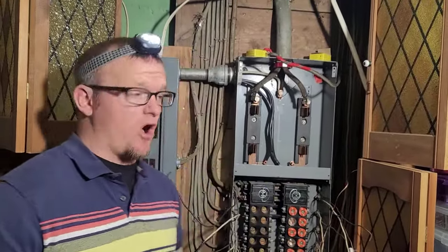I finally got my branch circuits worked in and terminated my mains. I'm working against the clock because the inspector is coming and I've got to get the power back on. I'm going to strip back each one of these to approximately a quarter inch and stick it inside the box. Then I'll start landing my grounds and neutrals — at the second point of disconnect, I'll land all the grounds to a separate bar and all the neutrals on the neutral bar.